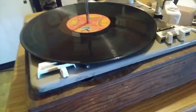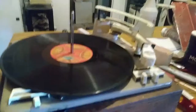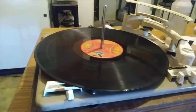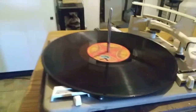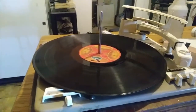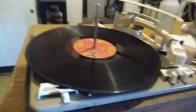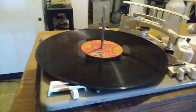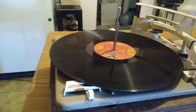The next project will be connecting this to the big stereo with a proper impedance match, proper voltage level match, and an RIAA circuit — for both this turntable and the Crosley — to make them sound proper on a system set for line-level inputs. This is as close to line level as you can get because ceramic cartridges are extremely powerful. This one generates about 0.5 volts and doesn't need the kind of amplification that a magnetic cartridge does.